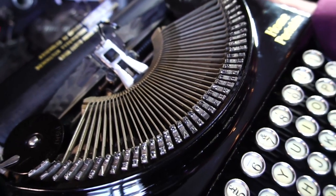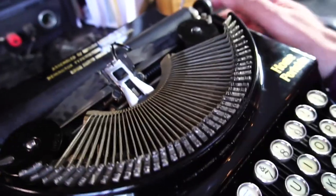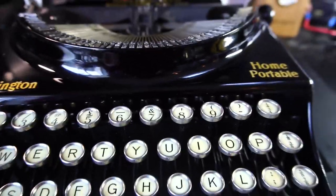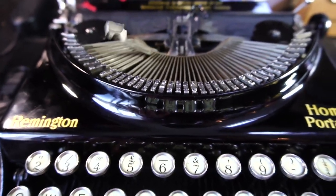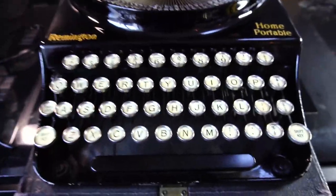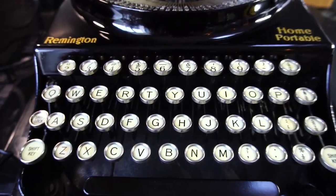The type slugs are in very good condition, not grimy, producing a clear print. Type bars are all free and working. It's always worth spending a bit of time getting these things cleaned up. One thing that happens with manual typewriters is the type bars are not free — some of them get stuck in the segment, and that just needs what they call a flush or a cleaning. It's a beautiful, very old machine but looking very fresh for its age.